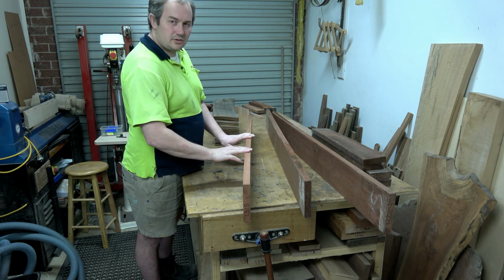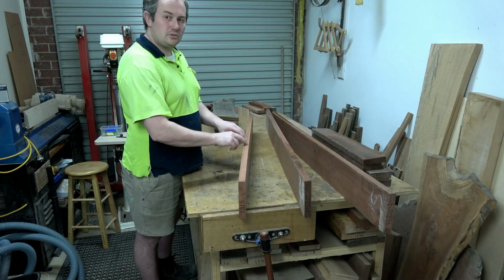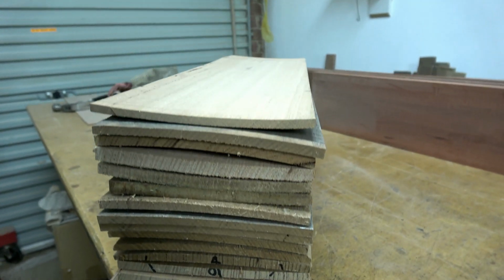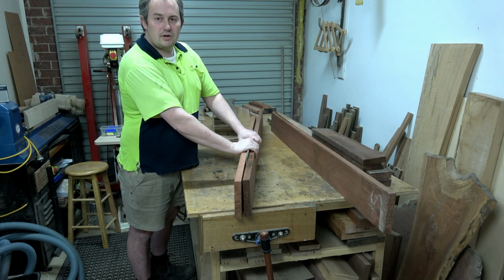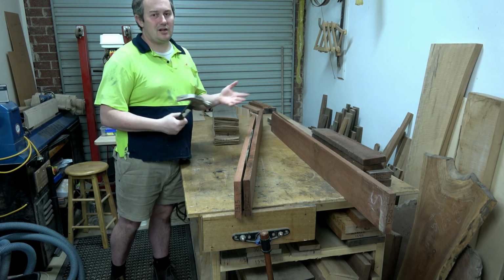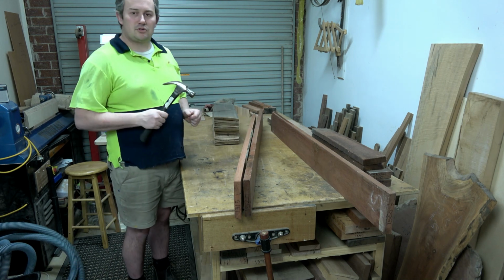So here on my bench, I've got boards of Jarrah. Now they're a little bit under an inch thick, or a little bit less than 25 mil thick. So it's a little bit too skinny at the moment, which presents a good opportunity to add a little bit of style while increasing the strength of the timbers by getting some offcuts of my Tasmanian oak that I seem to use all day, every day. Slip it in between here, bring another one over there, creates a bit of a sandwich, we glue them up, and that becomes a really strong, stable hammer, which is very unlikely to break if I was to really slam down on something, which I don't really do, but if I was, by laminating the timbers, it resists any splitting or cracking because the laminations make it super duper strong.